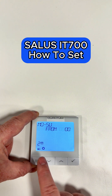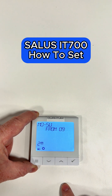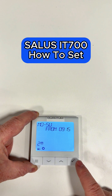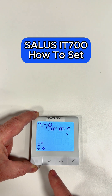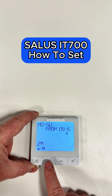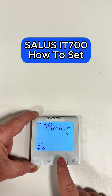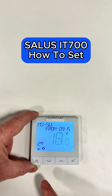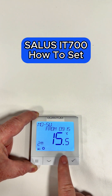Number two is what time we want it to go off. We've got it at eight o'clock, but let's put it to nine o'clock. Click the tick, and set the minutes to 15, so quarter past nine the heating will go off. Now this is the setback temperature — if it goes below this temperature the heating will still come on. You might want it down near 12 so the heating won't come on, or around 18 so if the house drops too low the heating would come on. We'll just put that to 16.